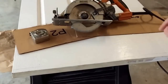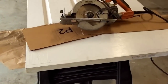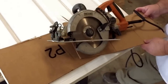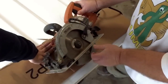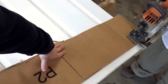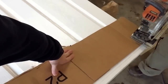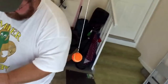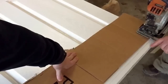Now we're just going to run the saw over it. Hold that cardboard like that, because the bottom of your saw will scratch the door. So I'm going to have cardboard on here. You want to have your saw set to where it just goes through that. So you want to keep your saw blade on this side — if you don't, it'll flake up on that side.